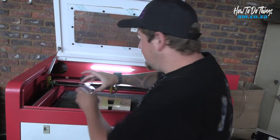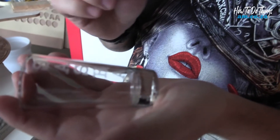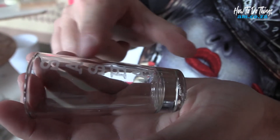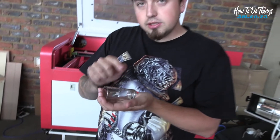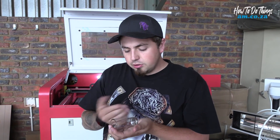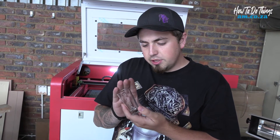Let's have a look at our engraving — this came out really, really nice. All of our letters are in focus, having made sure that the focal length is set to the middle. We run our finger over it and there are no shards of glass coming off, and everything is in focus which makes it look so good. With that little trick you can do so well on so many different surfaces — just keep in mind to set your focal length to the middle of where your two offsets are and it'll come out really, really good.